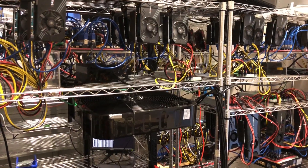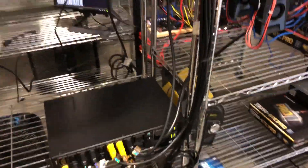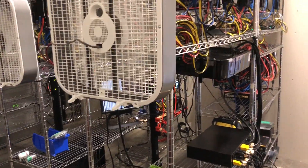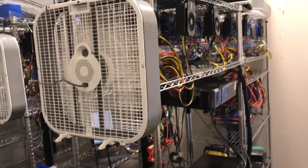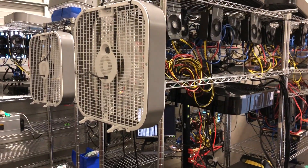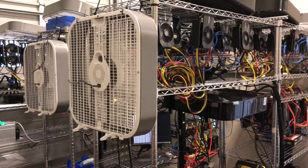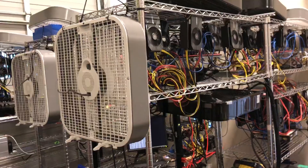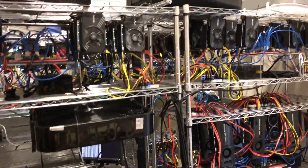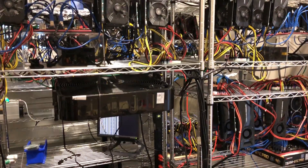That's the update. Check out the metered PDUs if you're expanding into a larger size farm — it'll give you peace of mind. When you walk in you can just glance down and make sure that you're within safe operating limits. You don't want to guess this. You can do the math all day, but I feel more comfortable having a digital readout tell me where I'm at. When it comes to high voltage lines, if you're using 120/110-volt kilowatt or watt meters, those kind of things just don't exist for high voltage — or they're quite expensive. They tie into the line or you'll have to break open the panel and put a clamp on it to see how many amps you're pulling, and you can't put the clamp around the whole line because it cancels out — you can only put it around one leg. So these metered PDUs kind of take the edge off. They don't tell you the watts, but you can do the math from there and see where you are.